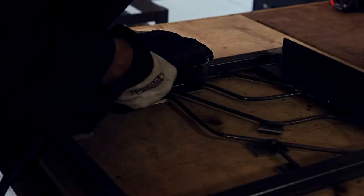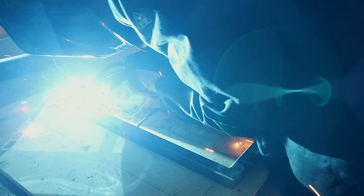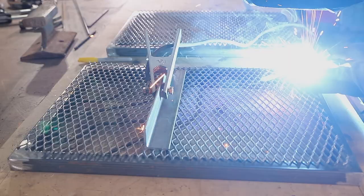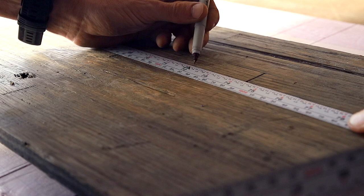I intentionally left the branches too long so I could trim them to their exact length at the end so they would fit down within the frame. I used the scrap from cutting the branches to add a few more limbs, and then I welded the trees with an eighth-inch offset into the door frame. To make the tree pattern stand out, I'm adding expanded steel mesh to the back side of the doors, which I cut to fit and welded in place. With the doors finished, I moved on to the woodworking portion of this project.